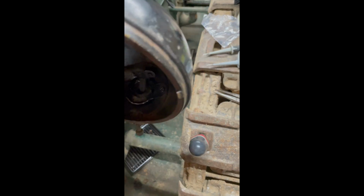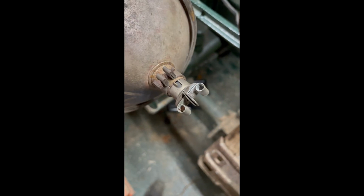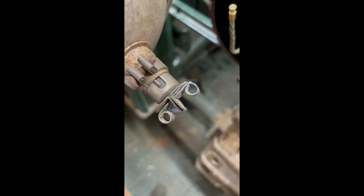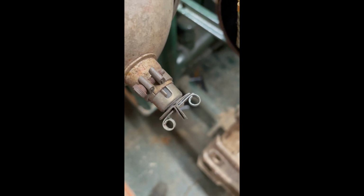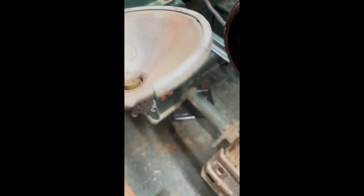I've got to change this now because I've just looked in the back of the bulb unit, and I need an earth. It doesn't actually earth out through the body. I'll show you why. So this is the reflector out of the lamp, and there is the back of the bulb assembly. So you've got one wire goes on one side, some insulation, and then you've got another piece of insulation. The wire goes on the other side, and that makes contact with that bulb.